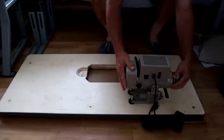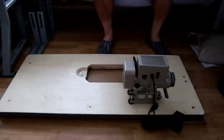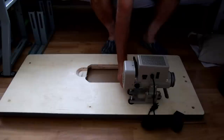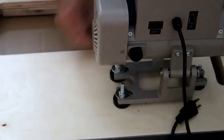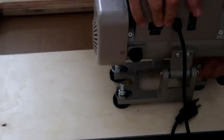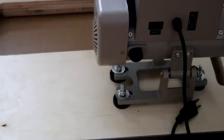You're going to pull it up here and try to line it up as best you can with that hole. When we get everything on there, we're going to put it on and kind of snug it, but we're not securing it. We're going to put a washer, a lock washer, and a nut on each one of these, and snug it just slightly so that motor doesn't rattle around until we're ready to make adjustments.